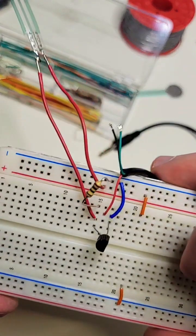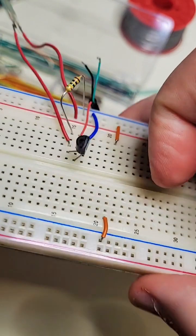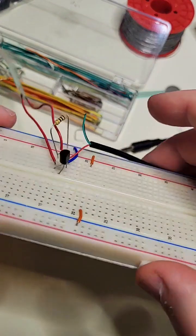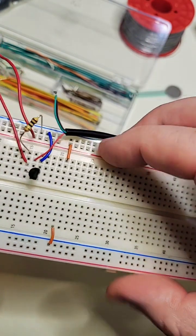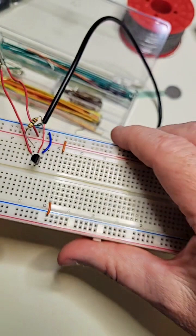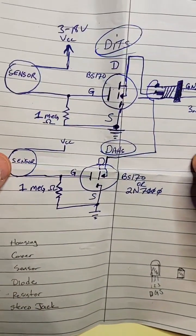The flat part of the transistor is on the right, so pin 1 going through rail 16 is the drain, and drain goes to the speaker. That's exactly how I have it here. On the schematic, pin 1 is drain, 2 is gate, 3 is source. The gate goes into pin 2, then out from rail 16 to the 3.5mm jack, and on rail 17 you can see the blue connection that goes to ground. I believe this side is fully built out.